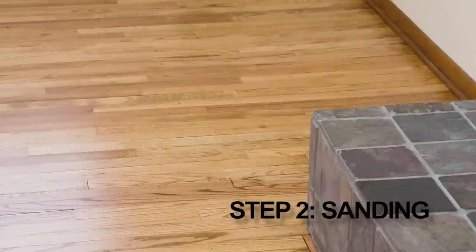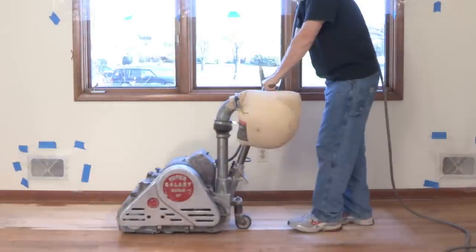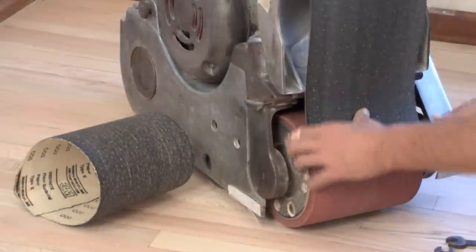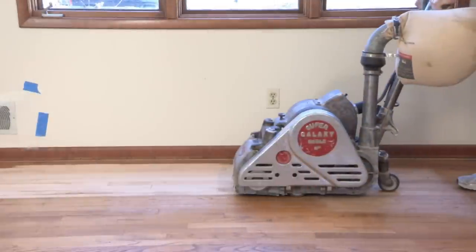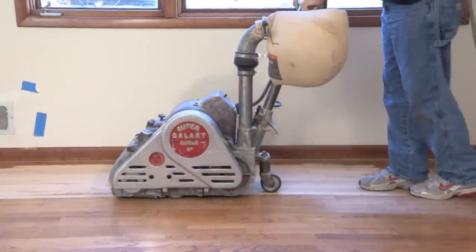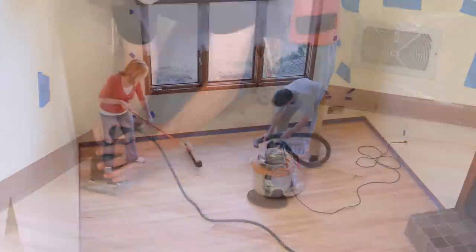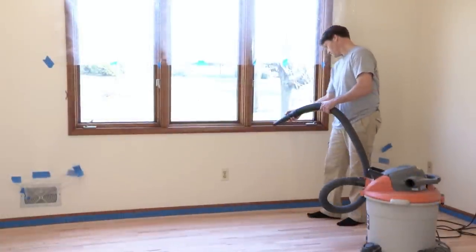When you're finished, it's time to sand. You can rent a floor sander at your local hardware store or home center. Be sure to read the operating manual for all recommended safety precautions. Follow the manufacturer's directions carefully when using your sander. A good rule of thumb is to start with a coarse grit sandpaper and finish with a finer grit. When sanding, always go in the direction of the wood grain. Keep the sander moving and overlap your passes. Sand the floor down to the bare wood, removing all stain and finish. Do a final sanding with 100 grit sandpaper. When you're done, completely remove all the dust from the floor, baseboards, windows, sills, and door frames.